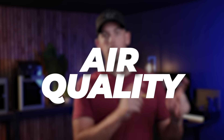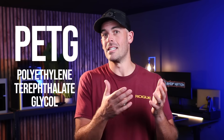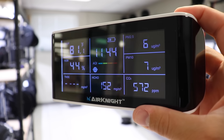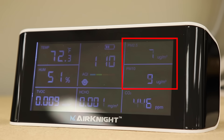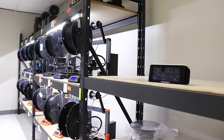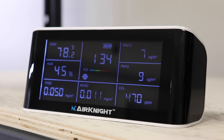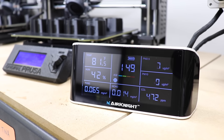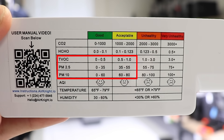Number three is air quality. Similar to the previous point, one printer is usually not a huge concern, as long as you aren't printing nasty materials like ABS. But 40 printers, even printing benign plastics like PETG, can generate VOCs and particulates. I was curious to know exactly how much, so I bought an air monitor which measures small particulates and VOCs. The baseline reading in the main area of my shop was normal, and placing it inside the print room showed not a massive difference. I even put it right next to actively printing printers, and the VOC count rose only slightly — still well within the safe and acceptable range of everyday use.